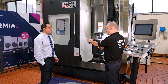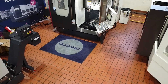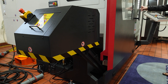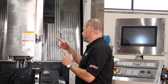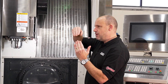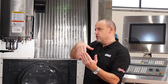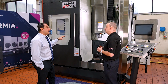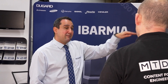The swarf conveyor at the side is quite small, adding to the compactness of the machine. The swarf evacuation happens at the front — there's a small channel where all the swarf goes in, and through the help of the swarf conveyor you can empty the swarf. Looking at the Y-axis coming out here, with 650mm of travel it has quite a long way to travel. Because the Y-axis is fully supported all the way and the machine comes with linear scales on all axes, you get exactly the same accuracy across the full stroke of the Y-axis even when the ram comes out.